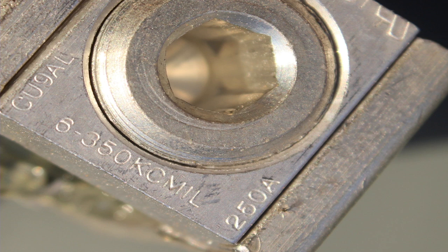Right. We can take a look at 310.15(B)(16). 350 kcmil at 75 degrees C is probably rated more than 250 amperes. Sure, it's rated 310. However, bigger wires in there, and maybe even compact conductors might have been installed. But no matter what, the utilities are trying to control the current going through their meter socket enclosure, through the meter itself. Exactly, as well as the meter socket enclosure.